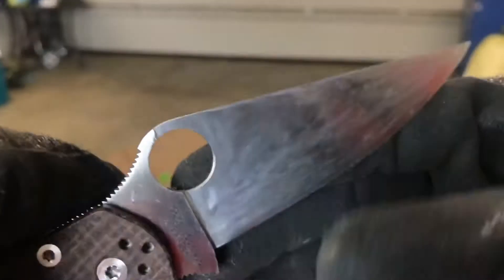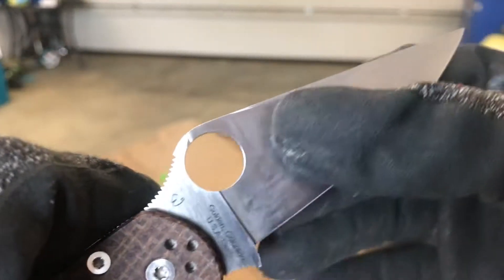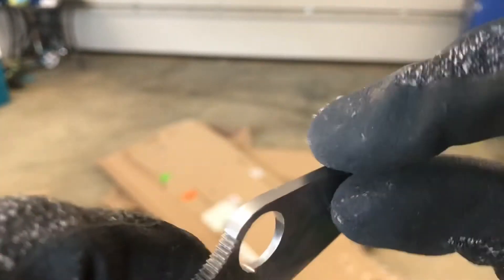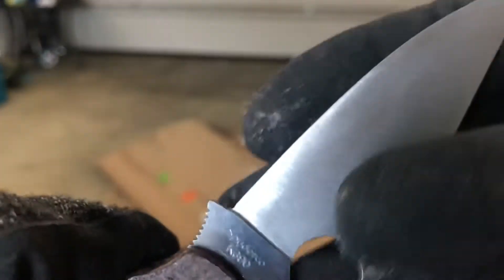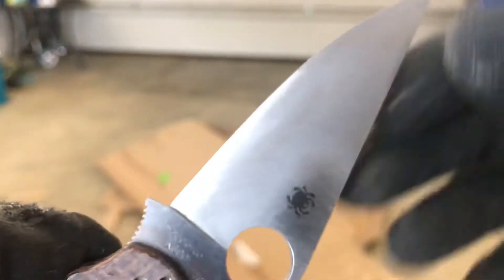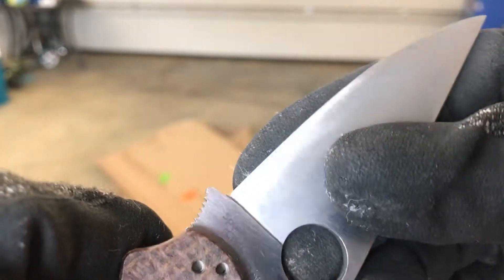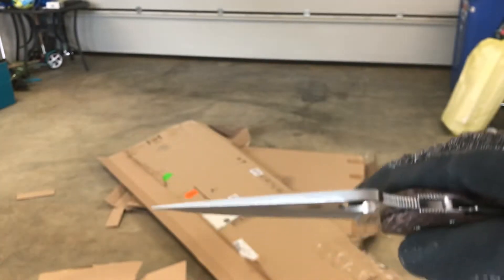On this side I tried to use a 2000 grit stone to decrease the drag, because the 2K finish is fairly smooth while the 400 finish is a little bit gritty. I may do the same to the other side, or maybe just hand sand it — although I'm guessing hand sanding K390 is not going to be much fun. I wanted to show you now how this blade with this convexing works.